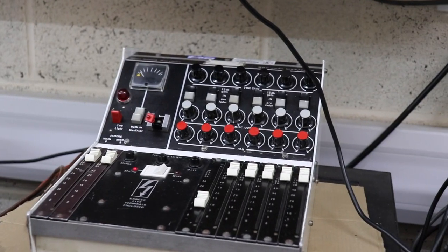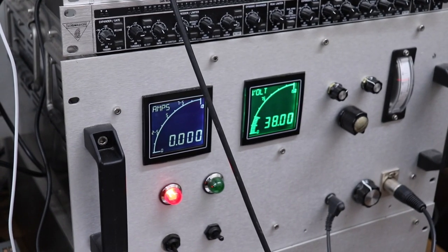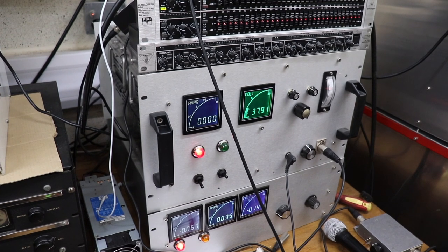And then what we're going to be using for our AM transmitter is my, let's zoom out a little bit, this is my Class E transmitter that I built about 3 years ago, I would guess. This is all solid state, PWM modulated, capable of producing up to 300 watts carrier, but we don't run it quite as high as that, as we'll be outside the legal limits.